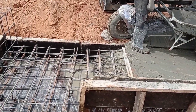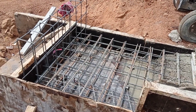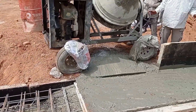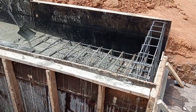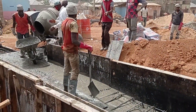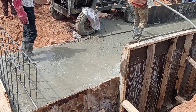They have been separated with the help of concrete spacers. For the head wall also, you can see that we have used Y10 and Y12 mm bars. The height of the head wall is being maintained at 60 centimeters. The total width of our culvert is maintained at 1.1 meters while the height is being maintained at 0.8 meters.